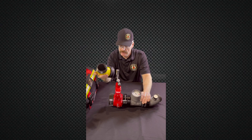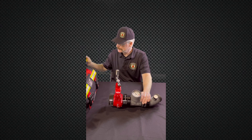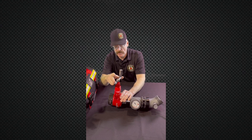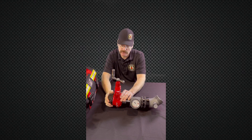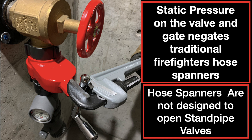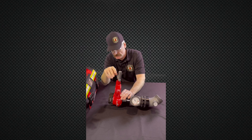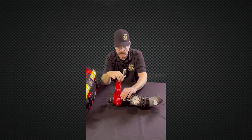We have the option in our kit to add an elbow on either side with our 60-degree elbow. Make sure you do your research on gates — we've had different manufacturers where the static pressure coming off the building is too great to even open the wheel. You need an 18-inch pipe wrench to open it. We found this Elkhart Brass one has been very easy to open even in buildings with lots of pressure.